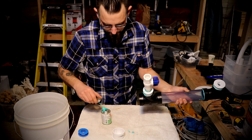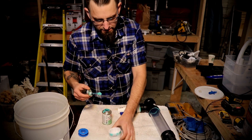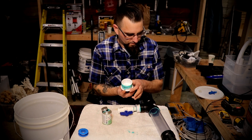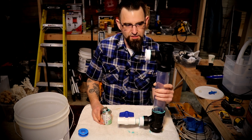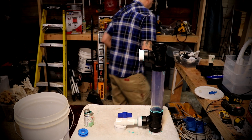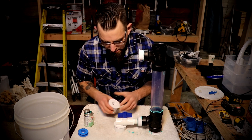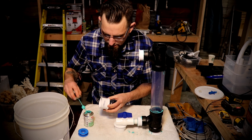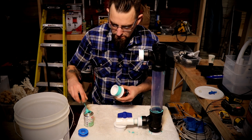Now to put the base on. I need three hands for this. Alright, we got this part — that's going to be the bottom. It's going to stand like that. Obviously right now it's going to tip over because there's nothing propping it up. Now I kind of messed up there on the inventory of parts — we don't need the cap, we need one of the caps like this. That's a two inch to three quarter with the threading on the inside. That will make sense here in a minute because this is where the water will go in to the reactor itself, via a pump.